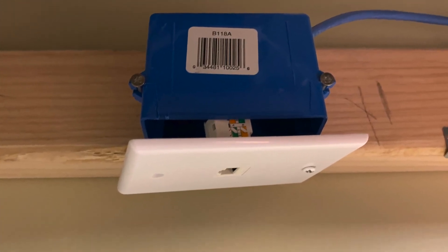All that's left is to give you a couple more tips and put the RJ45 plug on the cables. One last tip when running cables: do not kink the cable. Always be careful when you're pulling — don't get it wrapped up too much because if you have too much excess forming a drip loop, it can start twisting and kink. When you kink it, you can sometimes damage the copper cables inside the Cat 6. And if you're using a copper-clad cable — that's aluminum wrapped in copper — those are a little easier to damage. Also be careful when cutting for your RJ45 jacks or plugs: when you cut the sleeve, don't cut the cable inside the twisted pairs, or you're going to damage the connection, reliability, and connectivity.